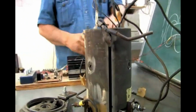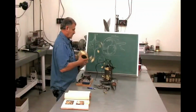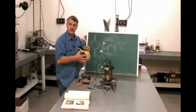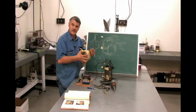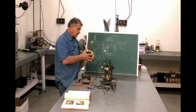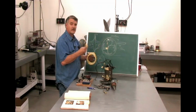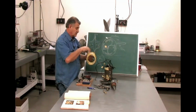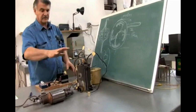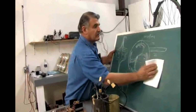Right. So this acts on the motor side as a big inductor because this was in series with the motor pulse. And it almost acts like the monopole motor where the coil gives you that sharp spike. Well, the next unique thing that's missing from all this is that, and I'm going to erase this.